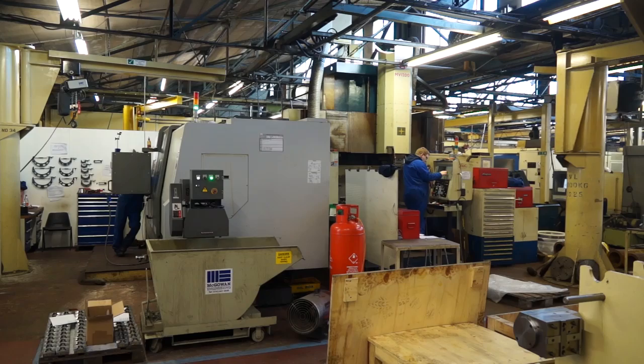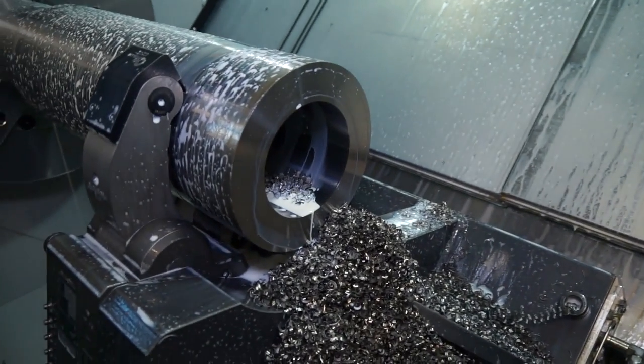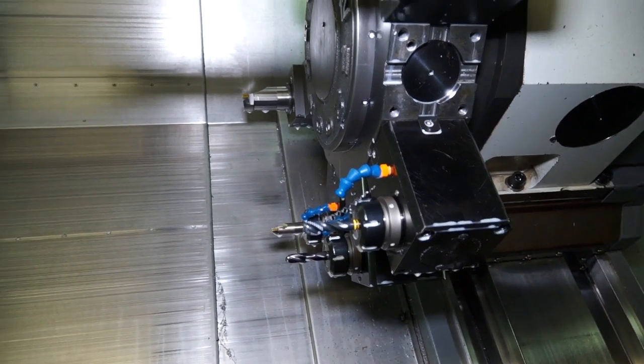So what sort of industry are you machining for, Tom? We machine mostly for oil and gas companies. I've got a part here on the floor which we've machined. We've machined this from solid. And what sort of material is this? It's just a 4140 low alloy. And I noticed by looking at the machine, it's not just turning — you're boring this as well? We're boring it, yes. This came from solid. They drill it, then bore it.